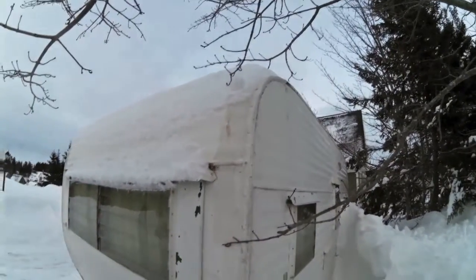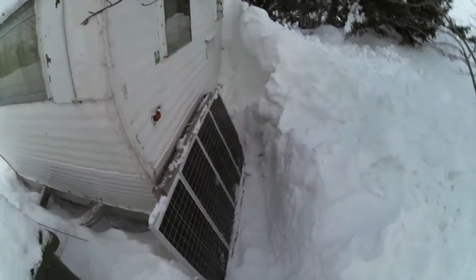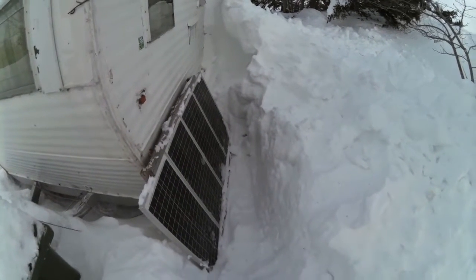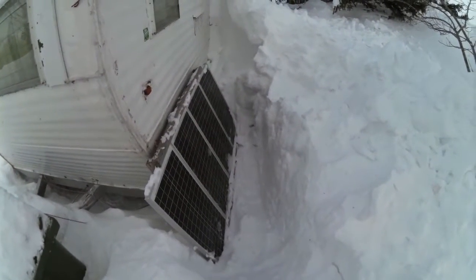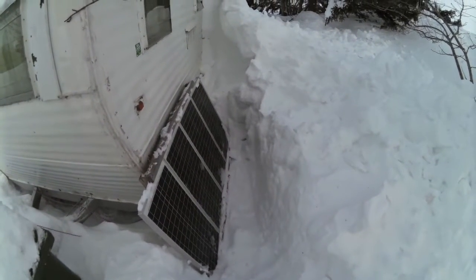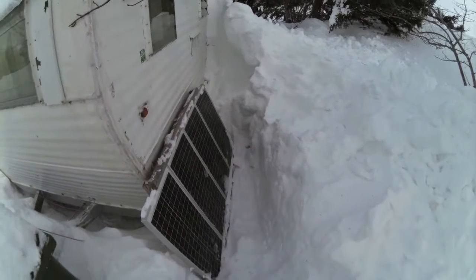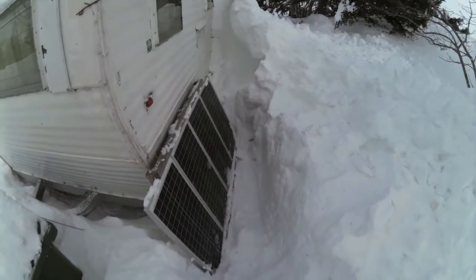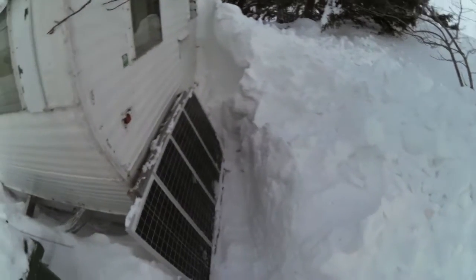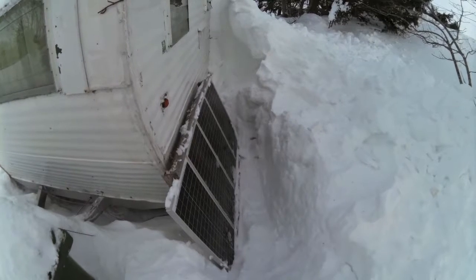You can see the camper is completely encased in snow. Every once in a while I have to dig this out because the solar charge controller does consume energy. If you're not charging it daily, not replacing that energy, you're going to run your battery down — and I did that once. You wreck batteries quickly by just letting them drain like that, especially when it's cold. So yeah, you've got to clear them when it's snowy and keep the snow off them.